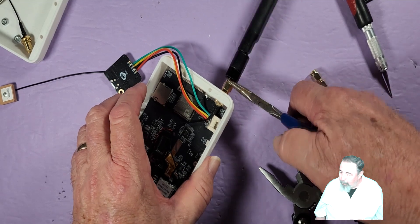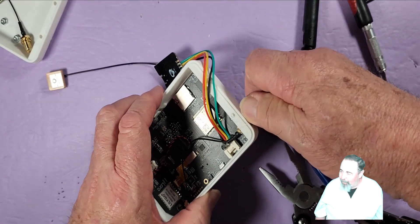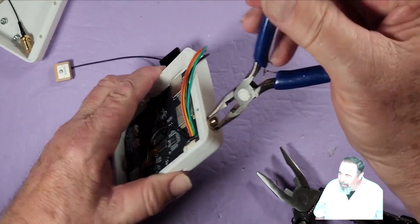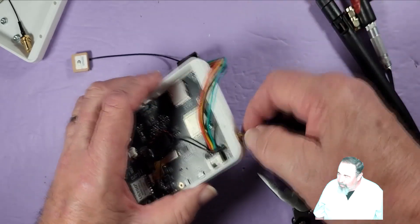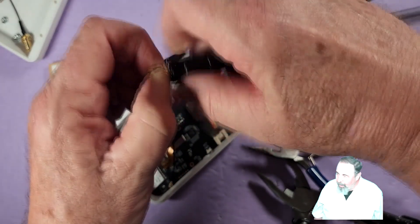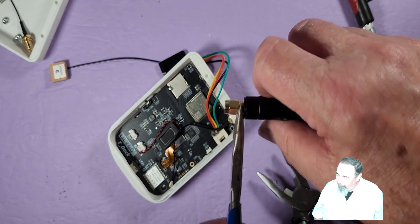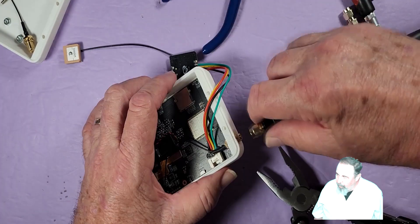So I'm going to take that off again. What we need to do is get that male-to-male adapter back off and use the male-to-male connector differently — tightening this end of the male-to-male SMA adapter directly to the antenna first, getting it uber tight. Then keep the lock washer on there.